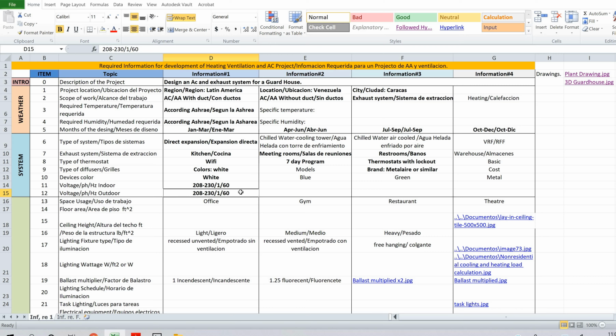Okay, with this information, we finished the first part of this video. So, checking all the information we got so far, we already know that we are going to design an AC and exhaust system, and where it will be located. The ductwork will depend on the space and the temperature. In this case, the client does not have any specific requirements, so we are going to use the ASHRAE recommendations. Months of the design: we are going to design a system for full year operation.